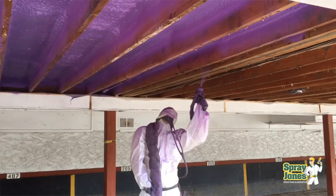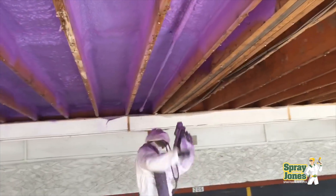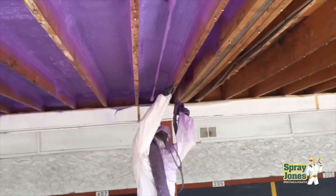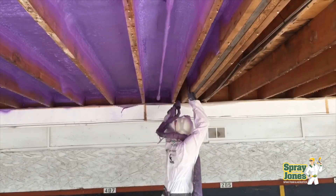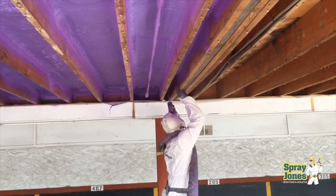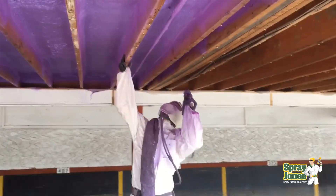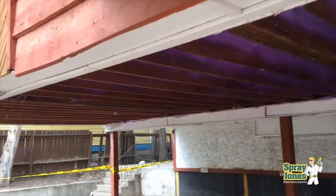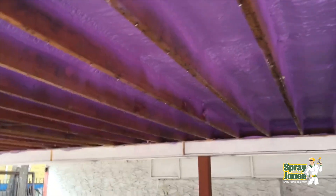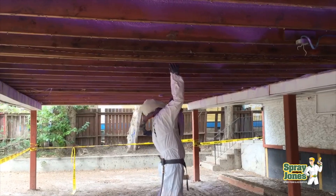One inch so far is passing all of the physical requirements. So physically and technically you're meeting the requirements of your air barrier and vapor barrier. But thermally, are you going to be satisfying what you need for insulation in your area at an inch? The answer is most likely not. Most codes require something in the R10, R13, or R15 range — these are minimums for under slab, walls, basement, and so forth. So getting somebody out to spray just an inch means all the overhead, setup, travel, and prep go into that inch, making it the most costly inch.